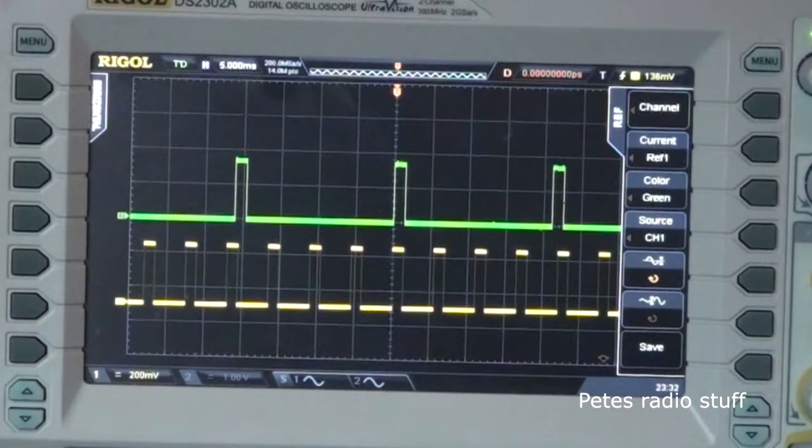But especially on only 3 or 4 channels. The old RC, very old RC, the refresh rate was very approximate. It was in some cases 12 milliseconds, 15 milliseconds, although the protocol at the time, right through, has been 20 millisecond refresh rate. But there lies, I say, the problem. The modern servo won't handle it. The modern servo won't look any different.